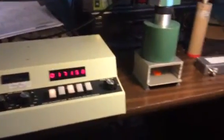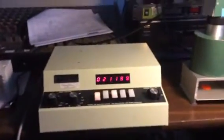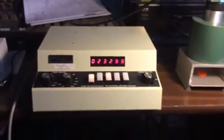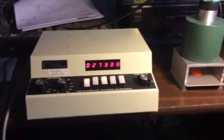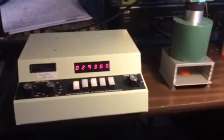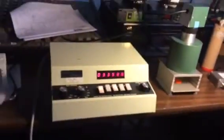The output from the 0.01 microfarad capacitor, which is coupled to the output of the first preamp stage, is going to my line-in of my sound card on my computer. I'm going to move this over here now where I have the Theremino — sorry about the pronunciation — the Theremino software queued up.